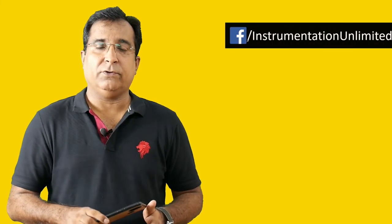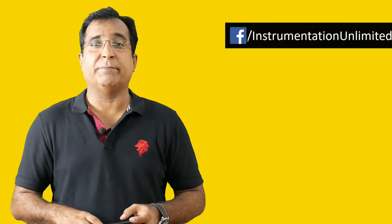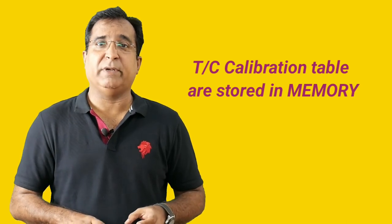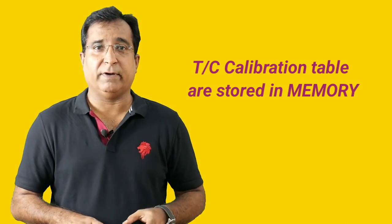Once we measure the true millivolt after compensation, this millivolt needs to be converted into a temperature display. A simple method stores the corresponding calibration table in software memory and refers to this table to determine the temperature corresponding to the millivolt developed, by looking up in the table from memory. Another method gives linear approximation using polynomial coefficients — analog linearization of the thermocouple output signal. Software linear approximation is popular because no large storage is required except for the predetermined polynomial coefficients. This is a very large subject and will be taken up some other time.